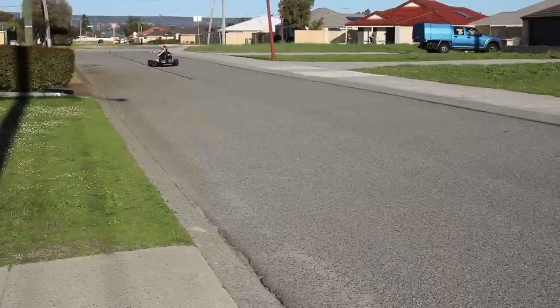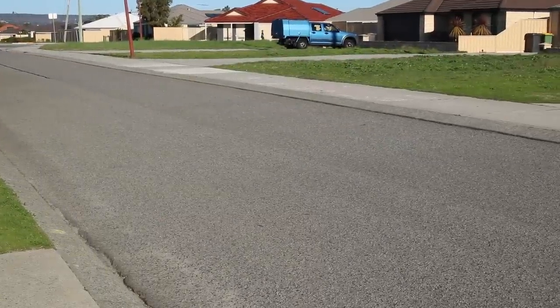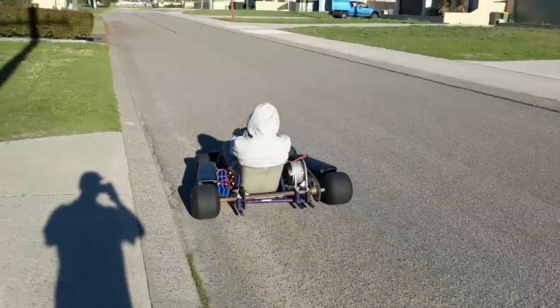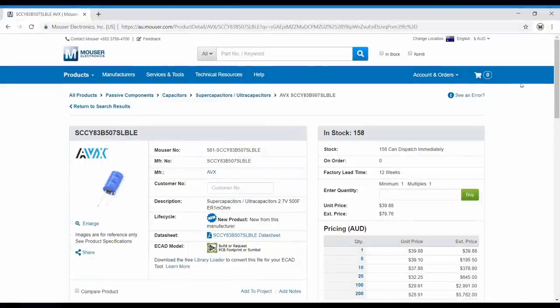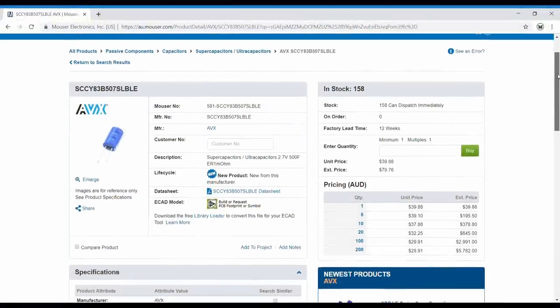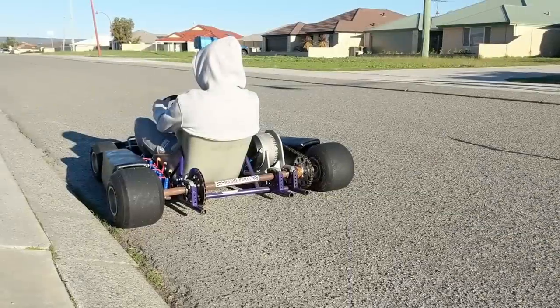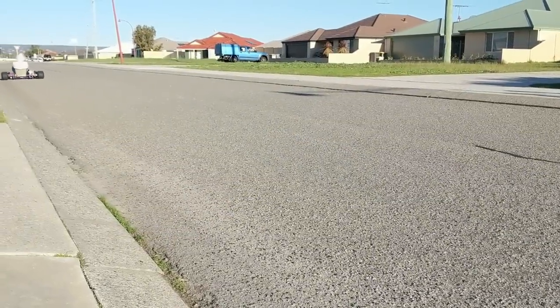The top speed is unchanged and the acceleration is not much different than before, honestly. Here's why: this is how far we move using just the super capacitors until they drain to below 47 volts, which is my cutoff. To put it simply, they just don't have enough energy density. The boards can handle up to 500 farad super caps, but decent branded ones are quite pricey — I may have to go down the eBay route for testing purposes in the future. For now, at least I've proved the concept works, and we have a strong platform to keep experimenting with.